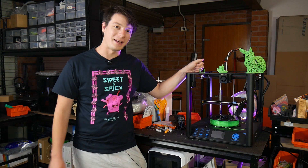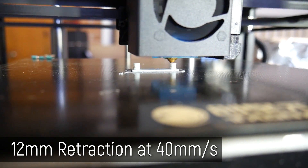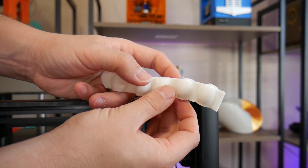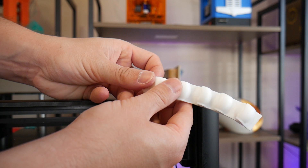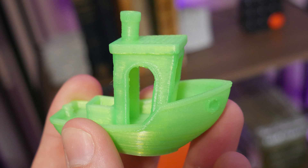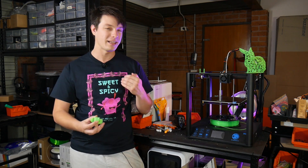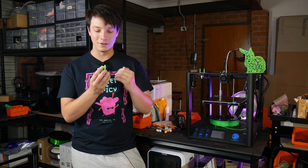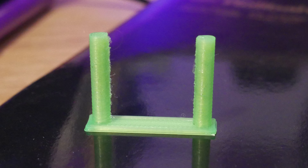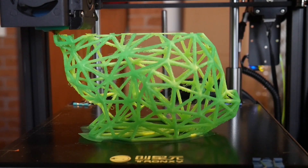What's not so great about this machine? The hot end leaves a lot to be desired. I had to ramp up my retraction to 12 millimeters at 40 millimeters per second to get anything usable out of it, and once I did that the stringing went away and I was starting to get really quite good prints. I've done some more prints since updating the firmware — this benchy is not bad at all, printed at 0.15 millimeter layer heights. There are a few areas where cooling is clearly an issue, and the heavy retraction is preventing filament from fully loading back in — for example that tiny bit at the back where the flag's meant to go. This stringing test also shows the best results I get using 12 millimeter retraction on this Bowden setup.